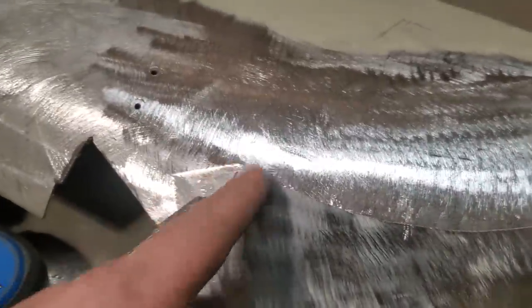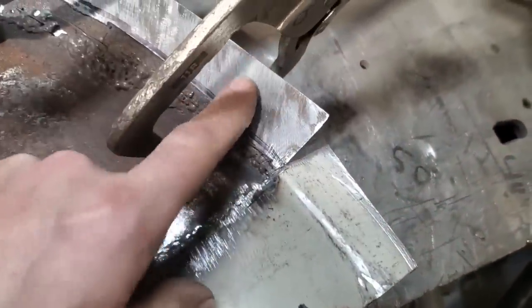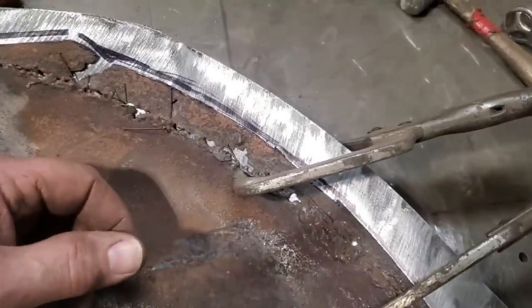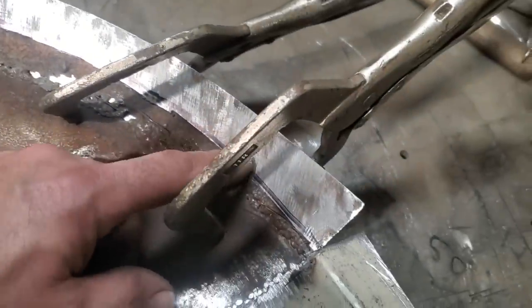I'm going to trim off these ends here now, okay? I'm going to trim two of them off, square them off there. Then over here on this side here, okay? Now, I got left an inch here, and I got an inch left here, and one thing I've noticed over the years is when it comes to rolling an edge, especially on a curved edge like this here, I could probably bend that on a 90 and then shrink it, okay? That was probably what you end up doing with it. But we're not going to use any tools like that on this here.